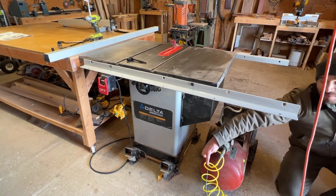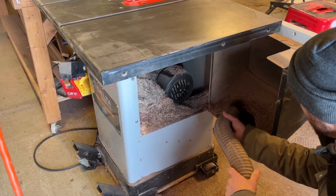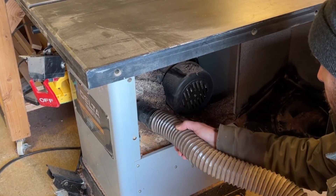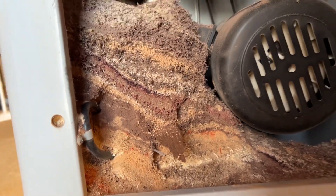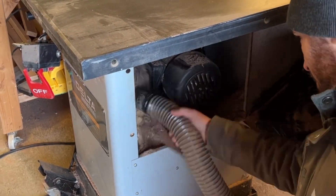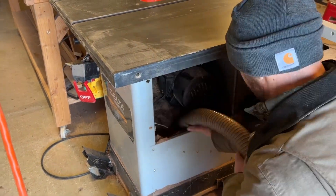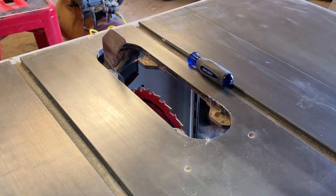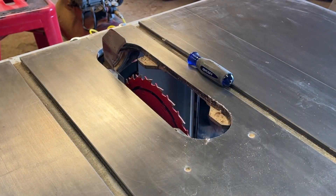I can't really think of a better way to waste time than disassembling something that I didn't need to disassemble in the first place. But I digress. The repair was pretty simple — I just cut the hose and reinserted it. The hose was the only thing that was damaged in that accident. From this point forward, I don't really think any further diagnostics are needed as to the reason my arbor won't go down. I'll go ahead and finish vacuuming the rest of this out and clean the arbor area. It's pretty bad in there. But before we do any of that, I'm going to go ahead and remove the blade and the riving knife from the saw. This will prevent any injury from the blade that I don't want.